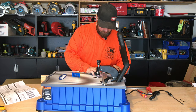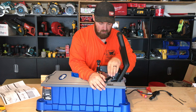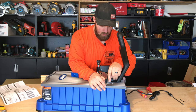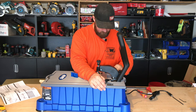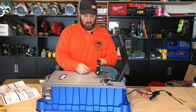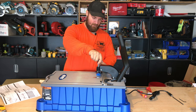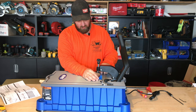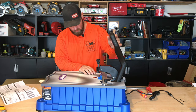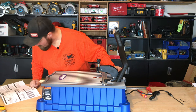Set the back of the fence even with the mark that's cast in here - which is awesome, so they won't even wear away. For three-quarter inch - boom, boom, so that's taken care of. We're going to line up our block for the slot that says three-quarter inch and begin to set the drill bit into it. A few moments later - I did that wrong.